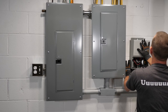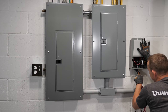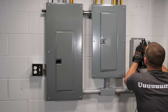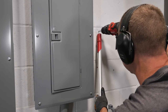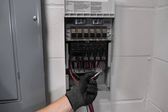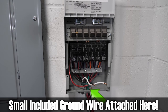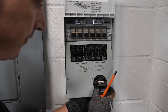I'm just lining everything up, making sure my squeeze connector that's going to hold the conduit is going to line up with one of the knockouts. Once I get that lined up, I'm just going to mark my holes. There we go — got the critical loads panel mounted to the wall. Next thing we can do is mount that plug to the wires and install the plate. So actually what goes on first is the plate — we'll do that real quick and pull our wires through.